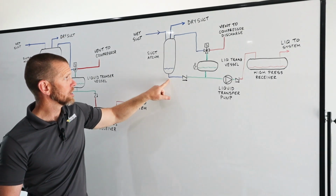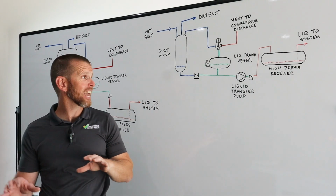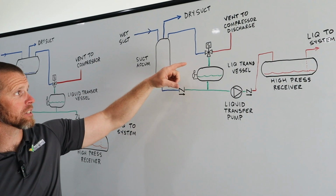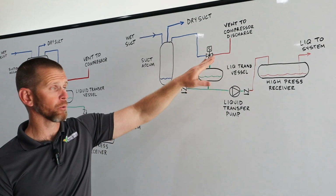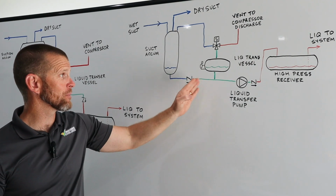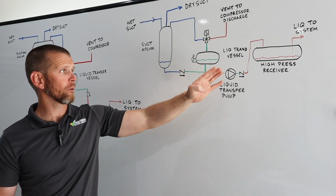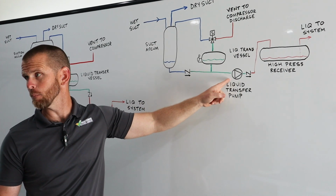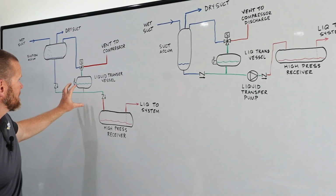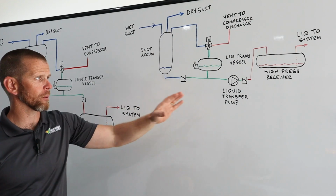So these two vessels, under the normal conditions, the way the three-way solenoid works and everything is the same, will be at the same level, okay? And once it reaches that float switch position, it will cause the three-way solenoid to be activated, subject the vessel to high pressure. It's on the high side of the system, but because all vessels are at the same level, there's no transfer that will take place unless we employ a pump. So that's where the pump comes in. The pump is basically serving as the gravity component in this example. So that's an important distinction there. That's what all the pump is doing.